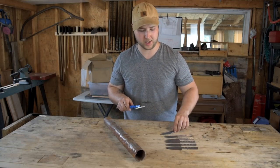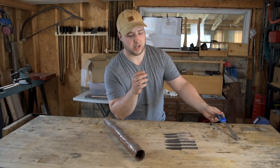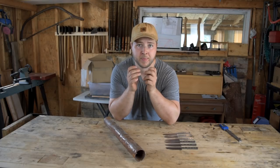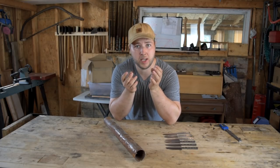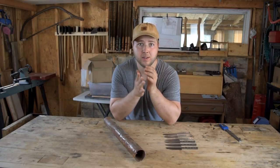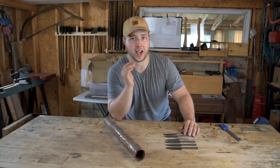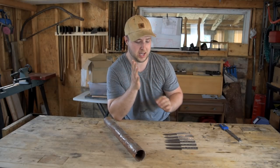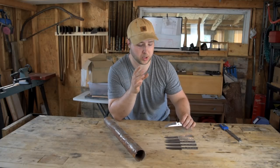You need that thickness left there because if you have too little steel at the edge, there's just not enough to hold heat and it'll either warp because it's so thin, or it'll crumble — I've experienced both. So you want that thickness nice and even so it heats to the same temperature and is thick enough to hold heat.